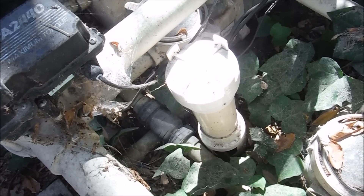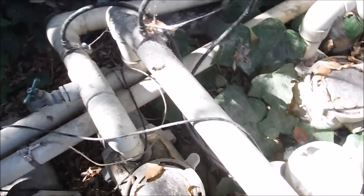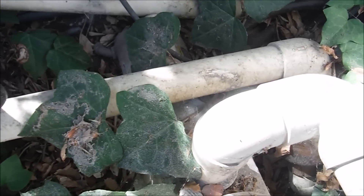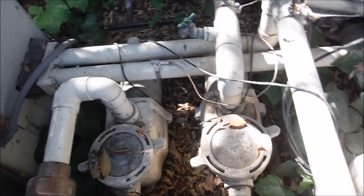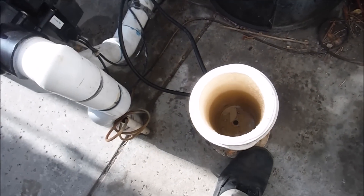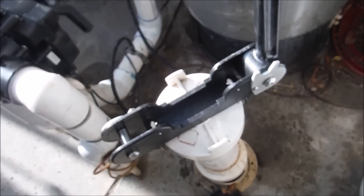When plumbing in the complete FlowViz you want to take some precautions. Don't plumb it anywhere near the Rainbow Chlorinator — if the chlorinator gets clogged, these connectors could be an issue and this would definitely not be a good location. Anywhere on that pipe in the back would not be good either. The best location is the pipe coming out of the filter, far enough away from the Rainbow Chlorinator that if there is any failure it won't damage the FlowViz. Check it frequently to make sure the tablets are actually melting, because those check valve elbows wear out all the time — if tablets aren't melting, go ahead and change that elbow right away.